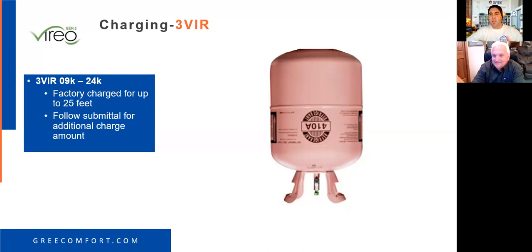And you know, the reason behind that is when we started working with these products, they've got the expansion valve in the outdoor unit, right? There's no expansion valve at the indoor. So when you hook up your gauges to it and you're reading your pressure, you're getting frustrated because there's not a high side port to check the pressure with, right? It's not going to do you any good.